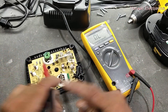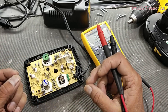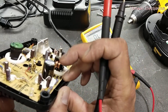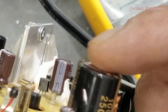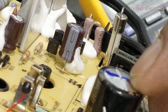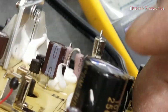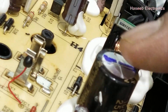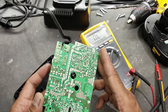Before connecting the fuse, we need to take some special care. We need to check the bridge circuit and we also want to test this capacitor. If we check this capacitor, its top surface is slightly raised up — so this capacitor has heated up. It is not flat; it has swelling here. So we want to replace it, or we can check it if we have an ESR meter to test it easily.